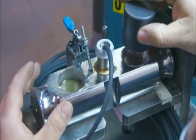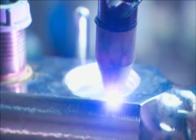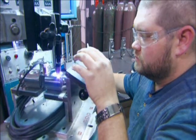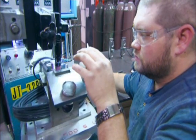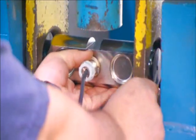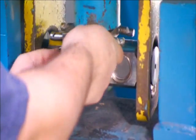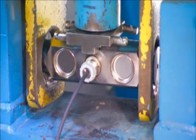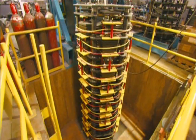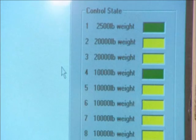The smallest amount of moisture or dirt would cause a strain gauge to malfunction, so they weld a cup over each one to hermetically seal it within the load cell. Every finished load cell undergoes a quality control check to verify that it works properly. The testing machine applies weight in increments until it hits the maximum weight the cell can bear — 34,000 kilograms or 75,000 pounds.